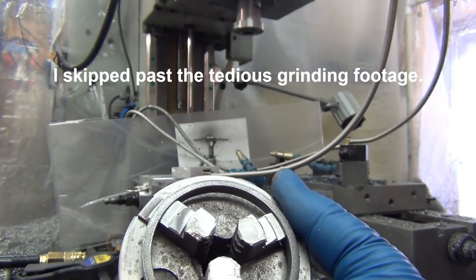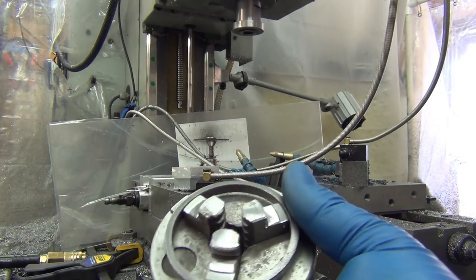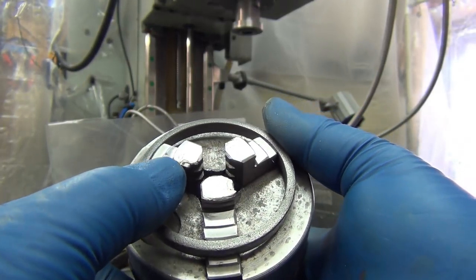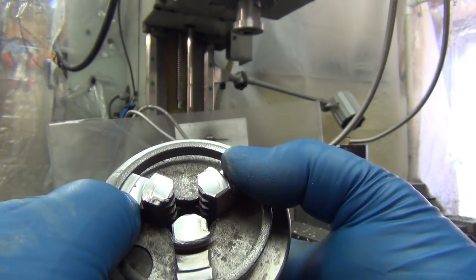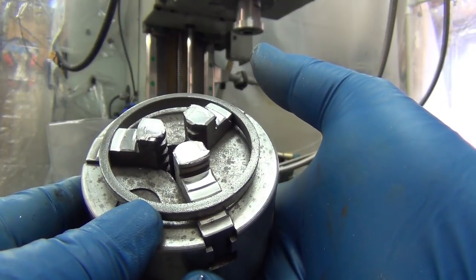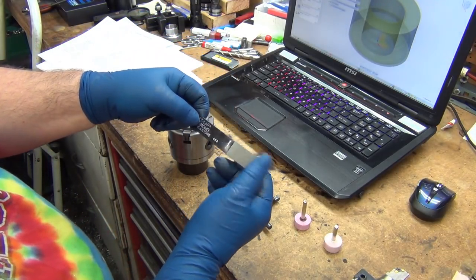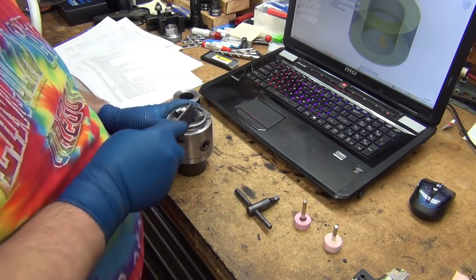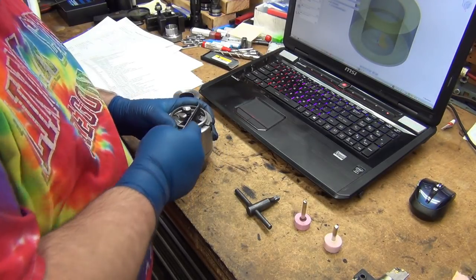I think I'm going to give that a try and see how I like it in action. I've got to pull out the diamond files or whatever and deburr some of the edges. But I'm not going to worry about getting these all the way cleaned up, because the reality is I might hit them again with another tool. At least two-thirds of the surface area on there is good to go, and these side ones are actually pretty darn clean except for that nick over here. So I'm going to take the ring off and see how it fits with a slug. Diamond easy-lap diamond honed stone — this is the coarse one, because everything on the chuck is hardened, so there's no point getting a file. A file's not going to want to touch it.